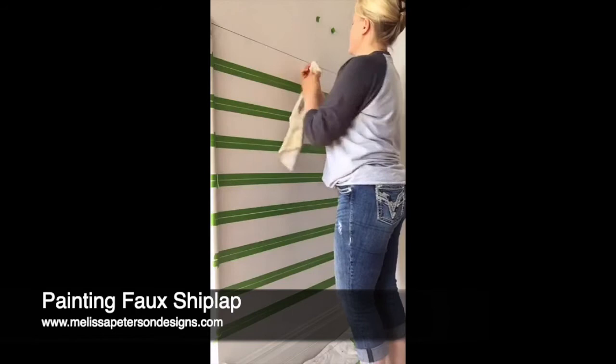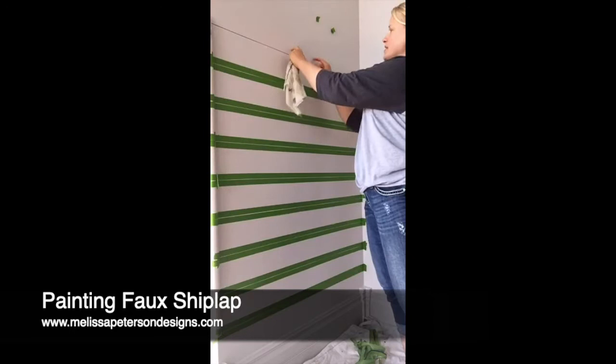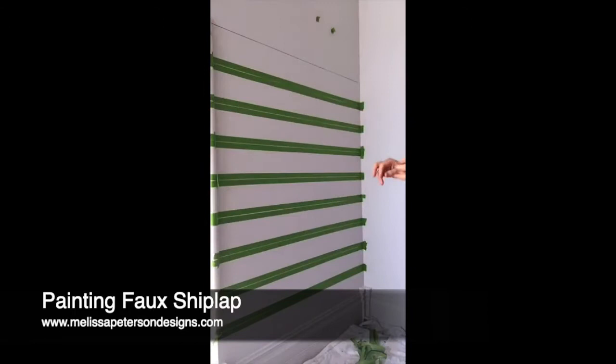and just go up to it and wipe along the side, along the line. And I had one bleed through on the other wall where I got a little crazy cleaning up and I actually erased the whole line. I let it dry and then I came back up and taped over it and overlapped these lines and then just repainted it and you can't even tell. So that's how I did that. And I'll show you really quickly how my other wall looked.